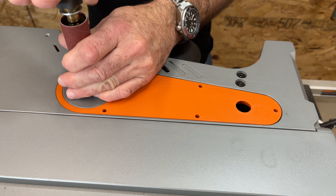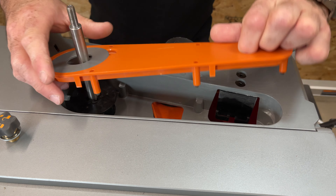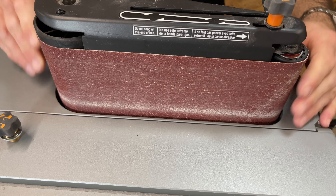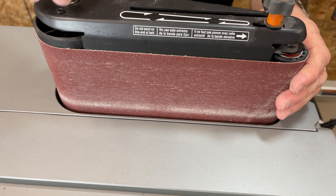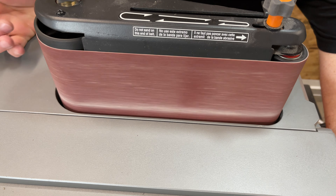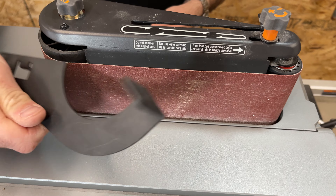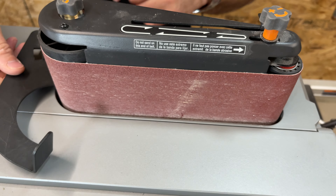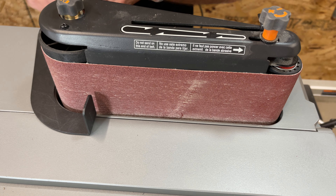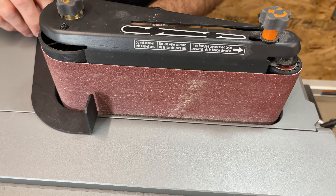To switch to the belt drive, you loosen and pull that off, remove the washer — it's got a captive washer on the handle. For the stop block, there's a little metal tab that fits into a groove on the back side behind the belt. You put it in, secure it with its own little hand screw, and line it up making sure it's not touching the belt drive.